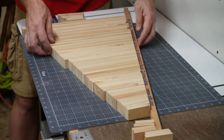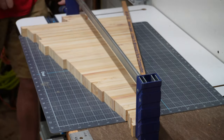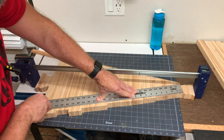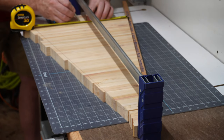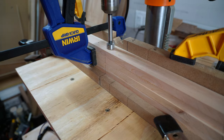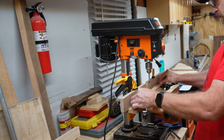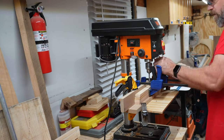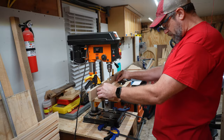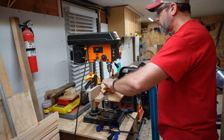Next, we're going to drill a hole in the center of each of these slats. So we need to find the center and mark a line so we know where to drill. Since both ends of your slats now have a 13-degree bevel, it doesn't matter which edge you use — just line up all your slats with a straight edge, take another straight edge that's long enough, find your farthest straight line, and draw a line on that outer edge. Then find the center at the top slat and the bottom slat and connect the dots. Make a test fit with your drill bit and your dowel. For this 3-foot tree, I'm using a 5/8-inch dowel and a 5/8-inch Forstner bit, and that fits perfectly. If you don't have a drill press, you can still do the same thing with a hand drill. I made a simple fence out of MDF so I could stack a few pieces and save time drilling. Find the center of your slat — if it's 2x4s you're using, it should be 3/4 of an inch. Make a line on the fence, line up your drill bit at the center point, line up your pieces, and make a hole. I like to clamp mine to the fence so they don't shift.